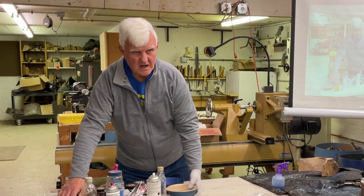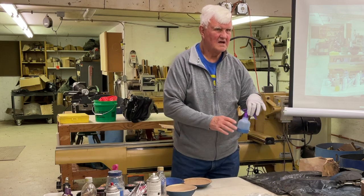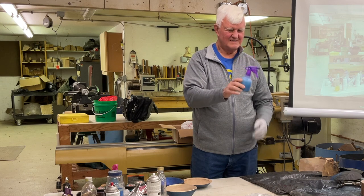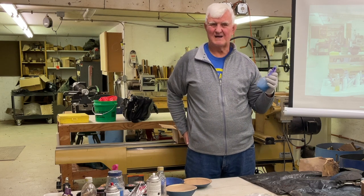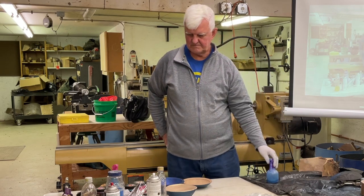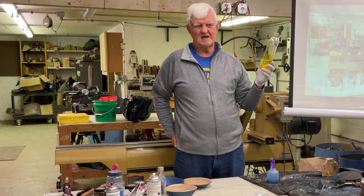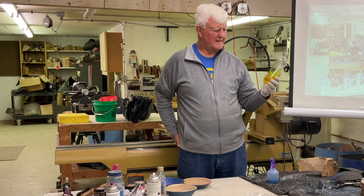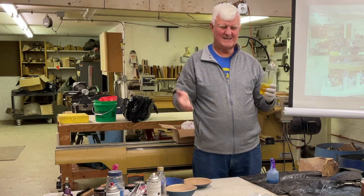When you mix that up in the spray bottle, does it get any kind of shelf life? It's been in here 10 days — I just add some more to it. I do thin the lacquer down. This was lacquer — I use a lot of lacquer. It dries quick, so it's really easy to use, and these bottles do not deteriorate. Right here is lemon lacquer — yellow Transtint put in this bottle with 50-50 or 60-40 lacquer-to-thinner, depending on how much you want to shoot and how much powder you're putting in. There's no real measurements here.